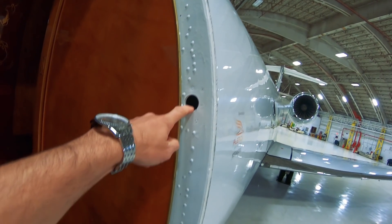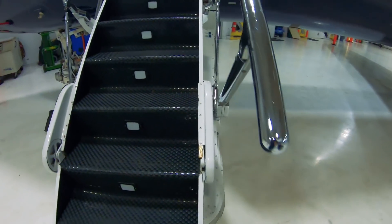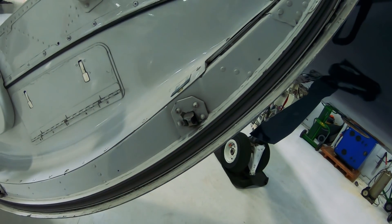Without bleed air, obviously that won't work and you'll lose pressurization very quickly — that's one of the reasons. These holes you see here are for the bayonets that actually lock the airplane door shut. There's one here, one down here, one over here, two holes here — and those bayonets are the ones that actually secure the airplane door shut.